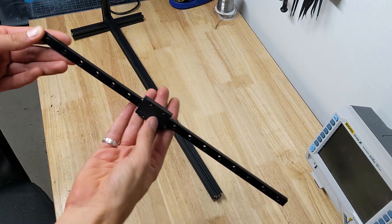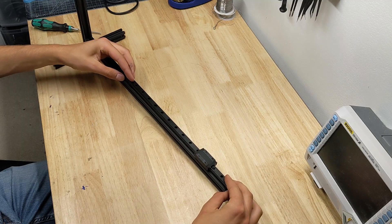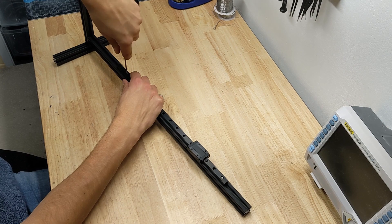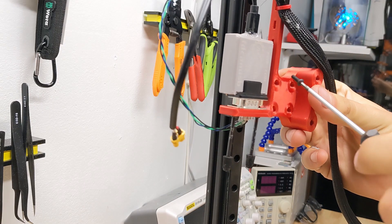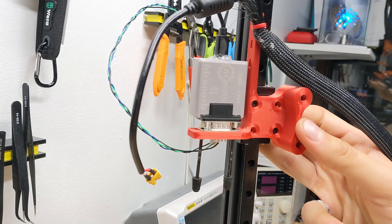I'm using a 400mm linear rail for the leg to ride on. When it arrived, actuation was rather crusty, but I amended this by disassembling it, flushing everything with WD-40, replacing any flattened balls, and then repacking it all with lithium grease. Doing so can be an easy way to improve the functionality of cheap, non-high-end-tier linear rails.